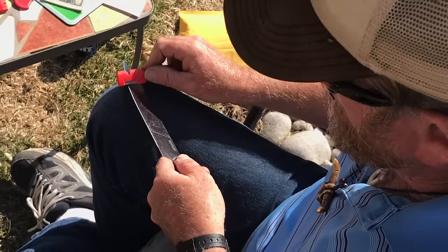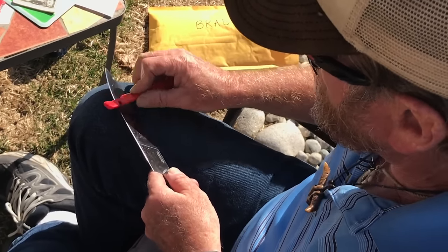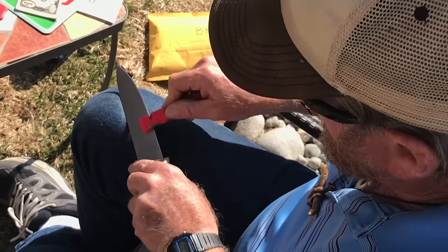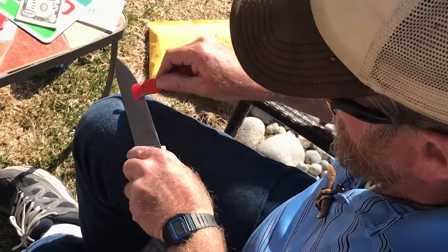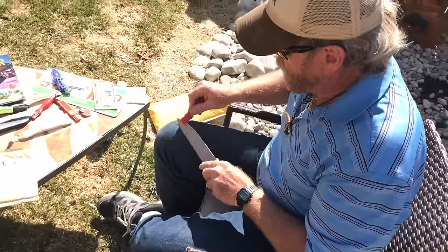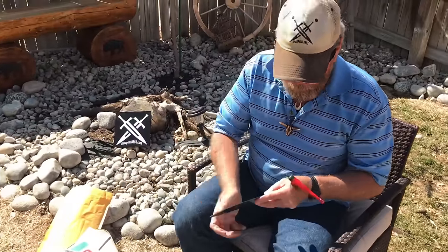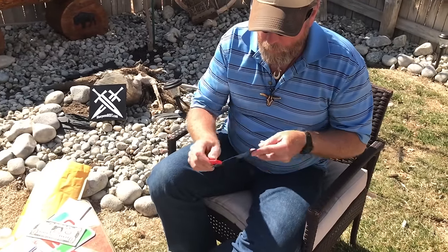It just gets better — one more time. I can still see just a tiny bit of glare on the cutting edge, so I'm moving along, actually rolling it in my fingers. I roll it over this way, roll it back that way, going right on out, coming back this way, turning it over. I've got to stay down at my 10-degree bevel. This knife was slightly harder to sharpen because I think it was around 14, 15, or 16 degrees on the cutting edge.